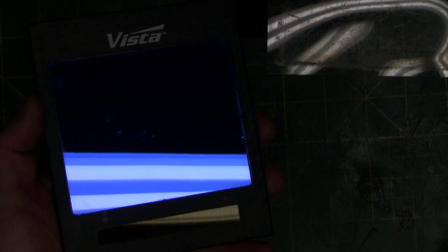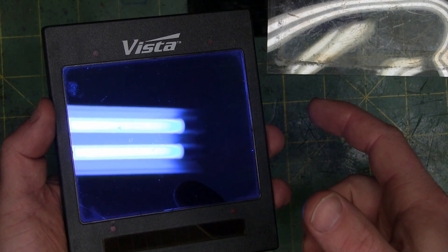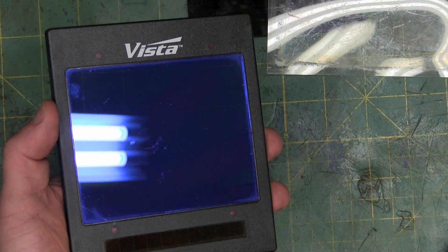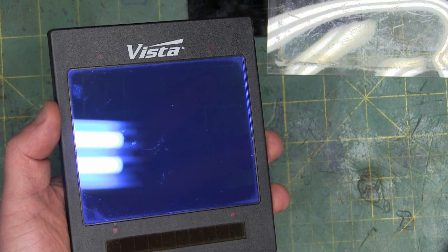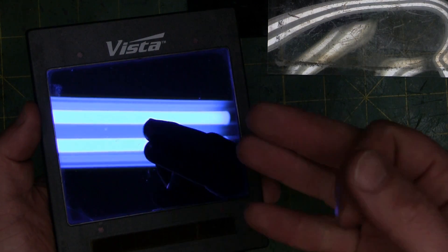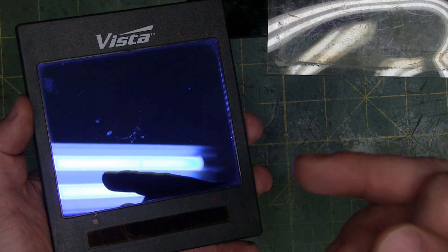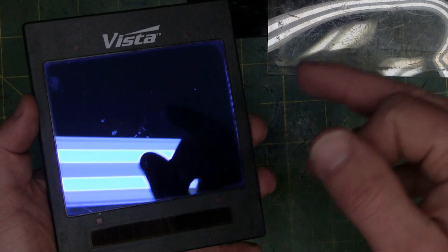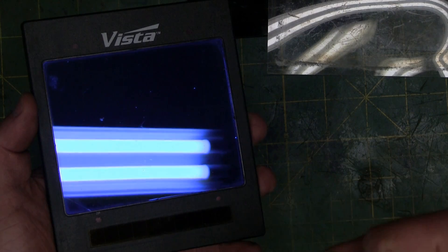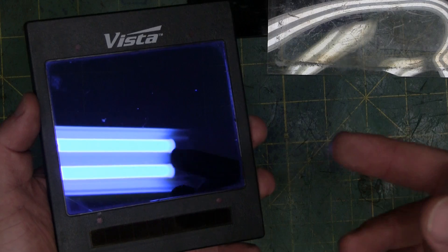This module is to protect you from ultraviolet. Some guys like to tan their pasty white eyeballs, but I don't care for the after-effects of two days of blinking sand out that never goes away. The only thing is there are three types of radiation. When you strike the arc, those angry electrons excite the air molecules and whatever shielding gas molecules, causing it to turn into plasma. That plasma puts out a ton of electromagnetic radiation.